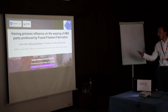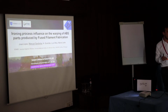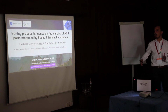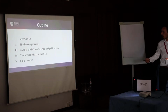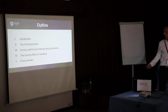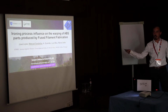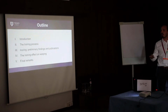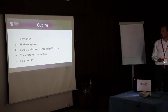So this was the idea I had like 2 years ago, more or less, applying the ironing process in fused filament parts. So I did the first experimental test, but since then a master's student is now working on the final results. I hope I have the chance to show them in this presentation. And so actually I will not only talk about the warping of ABS parts and its influence with ironing, but a brief overview of what we did with the ironing process on fused filament fabricated parts.